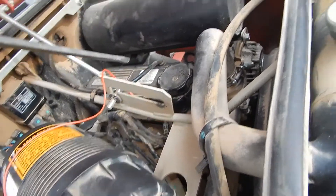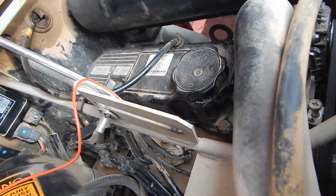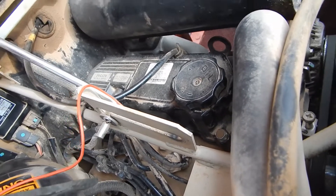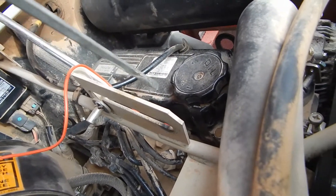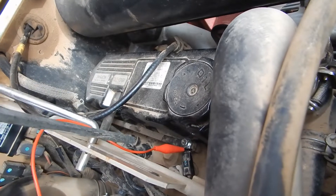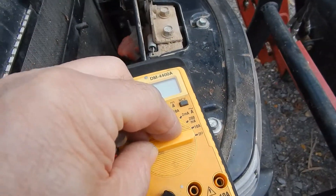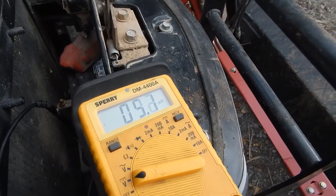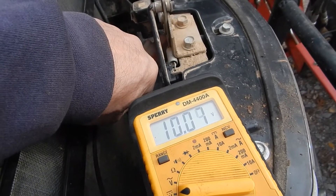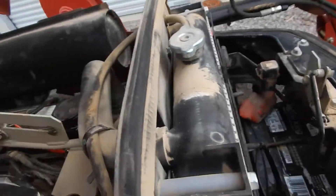We're talking about a Mitsubishi diesel today. This is a pre-chamber with glow plug diesel engine, and trust me, you do not want to put starting fluid in here. So I cleaned the power feed line here and tightened it back down. Turned on the switch, and all of a sudden my readings went down to a little over 10 volts — 10.4 — that's basically a dead short, warming up the wire on the glow plugs, which confirmed they were working.